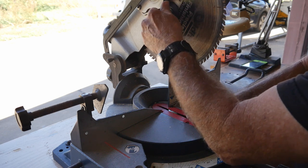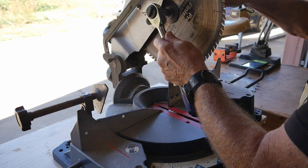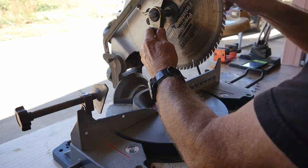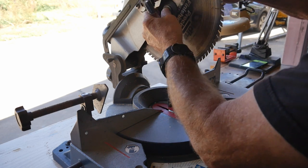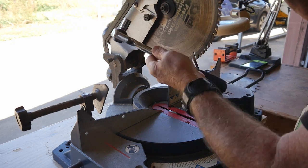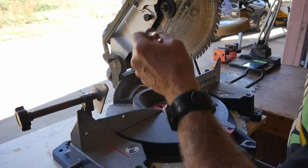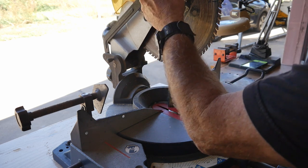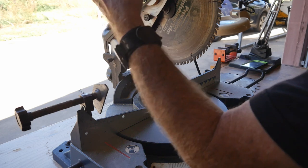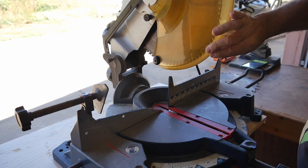I'm going to depress the button back here on the motor that I showed you earlier, and now what feels like we're trying to unload the bolt is actually going to tighten it. It's going to feel like we're unscrewing this thing, and it's really backward — these left-hand threads really throw me. I'm pretty snug there — anything more than that would be unnecessary. Take the block of wood out, bring this guy down, and I'm holding the plastic on an angle pushing, holding the whole thing down while I tighten this screw back up. Changing the blade on this saw is actually really a breeze — just that left-hand thread thing, you've got to know that or you'll get yourself in a heap of trouble.